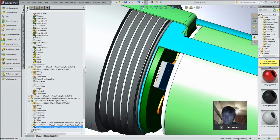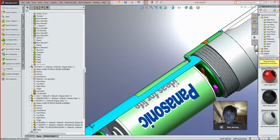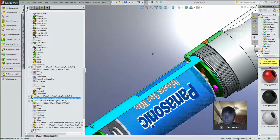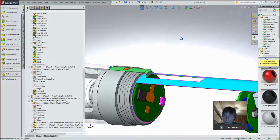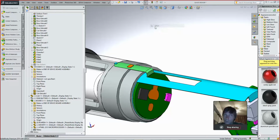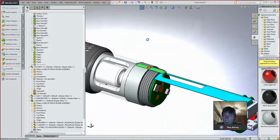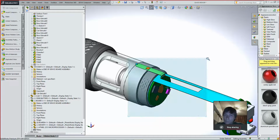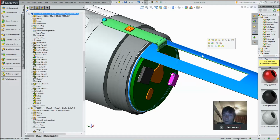So the MOSFET is down on this board, and that's actually over on the other side here, right over there. Right? Is that correct, Chris? Yep. So that board 3 on top there, that's the one we're currently working on the redesign of that's going to incorporate the MOSFET, the Atmel Tiny 2313, I think, chip it is, and the other components of that. Okay. And that's probably where we'll later utilize those extra 2 channels that would be on the ZIF connectors for data purposes. And that would probably also be something similar at the lower end board set for the micro SD card as well.